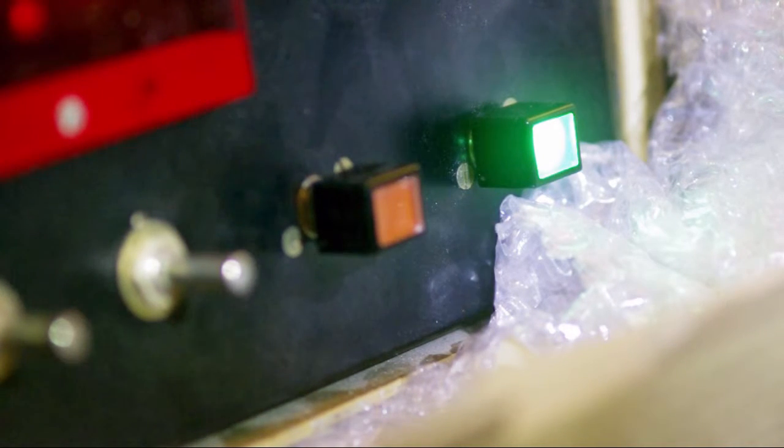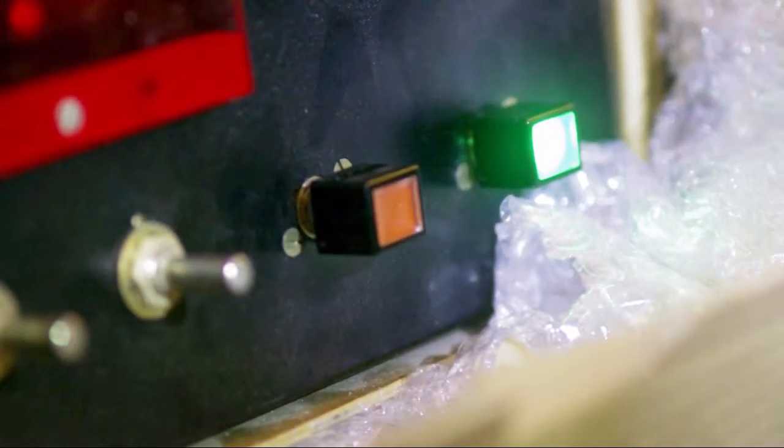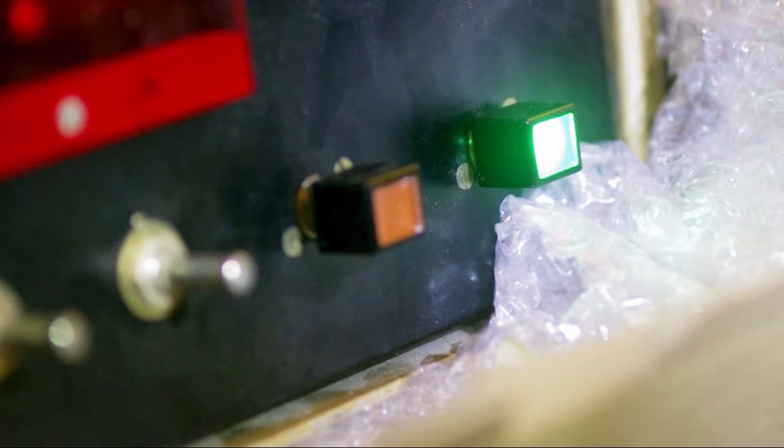Fan always runs. And as you can see, that's the green. It became pretty bright. Green LEDs are pretty damn bright. And that's running at around 10 milliamps. With the old one, it was much less visible, and I had to actually bypass the 1Ks, just use 1.8K as a series resistor at around 15 milliamps. It wasn't even half as bright as this one.